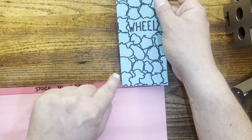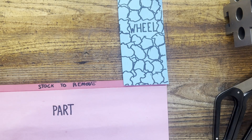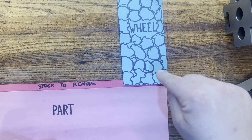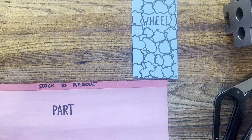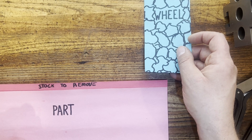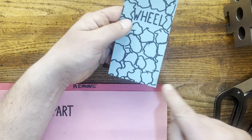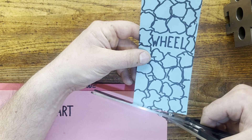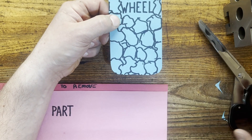Because one or two grains are doing the bulk of the removal, the cutting forces tend to be quite light — you can see later in the video I'm doing all the roughing with just one screw holding the part down and it works pretty well. Where this is used in industry is on very slender cylindrical parts; you can almost follow a profile like a lathe would, and because the cutting forces are so light you don't have nearly the deflection problems. The step-over amount is a factor of the grain diameter, and grinding wheels have small radii on the corners — about best case one grain radius.